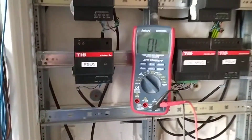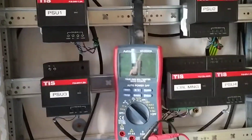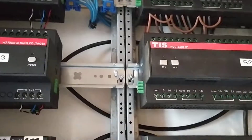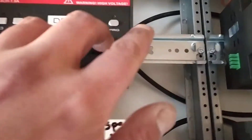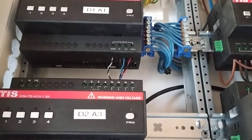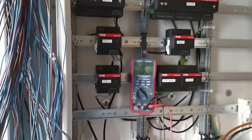As mentioned in the previous video, with your multimeter on continuity mode, you can test just before powering up whether you have made the proper connections. For example, test continuity between the data minus and all data minus controls and ground, and between data plus and the 24 volts across all of them.